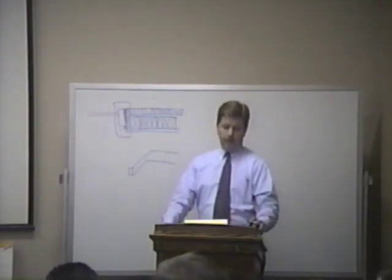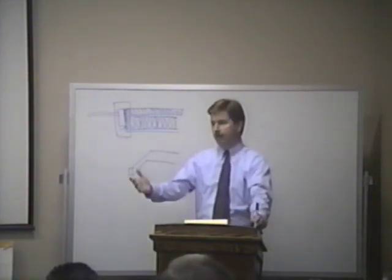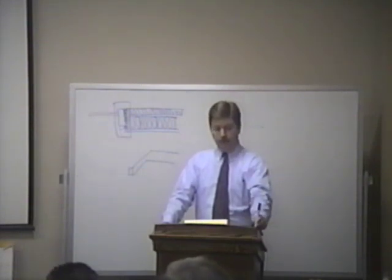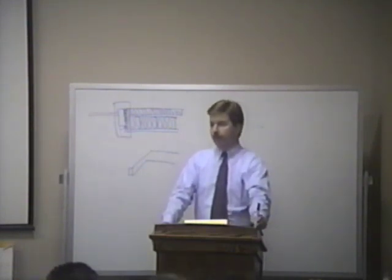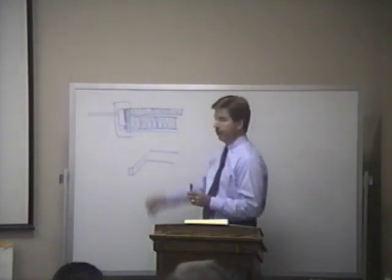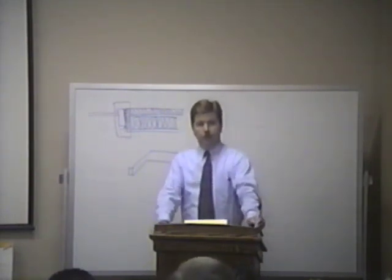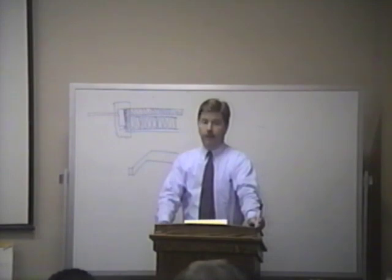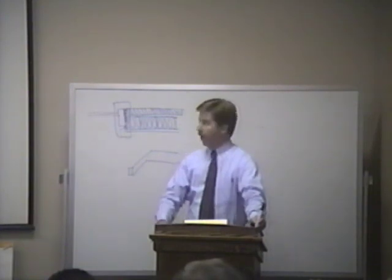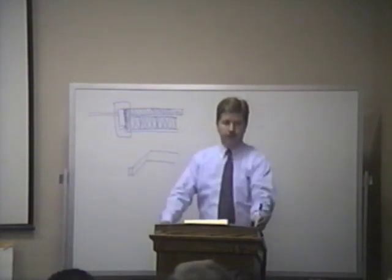Right. Well, the one thing I was going to point out on that is the house that we designed, our goal was to shoot for 0.5 instead of 0.75, which was the standard. And we've been told in instances where some people had achieved 0.3 in terms of infiltration rate design. But what they experienced from that, for example, in a house, if you Visqueen the walls, you never Visqueen the ceiling. Over a period of years, you will put your finger through the drywall. You just literally push through because moisture has to have a way to get out. Your latent moisture and built up moisture from cooking, showers, bathing has to. And that's why I prefer the Visqueen on the inside. All that has ways to get out without getting in your walls and everything, causing dry rot problems.